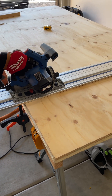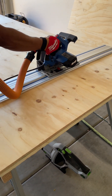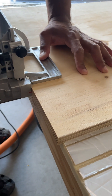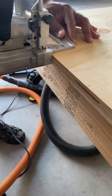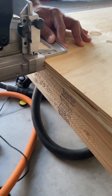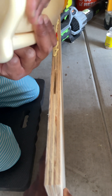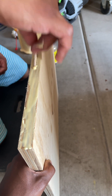There are many different ways to construct the storage bench, but Bernard built ours using a biscuit joiner. The way a biscuit joiner works is it creates a groove in the wood, and then you insert a biscuit — which is actually compressed wood — along with some glue. When you put the two pieces of wood together, the glue causes the biscuit to expand, creating a better bond and better stability to the build.